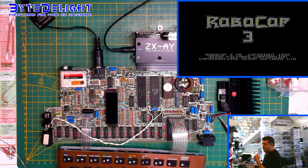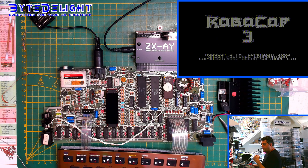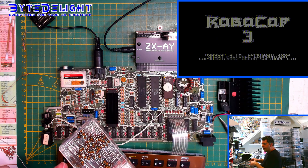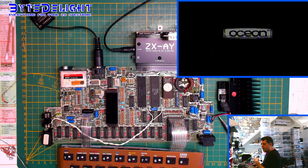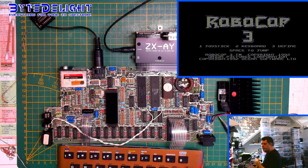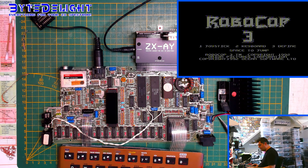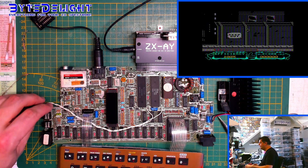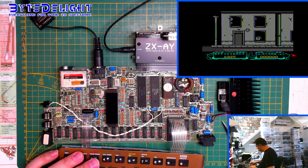This is way better — you can see it directly. Two small parts. The inductor I'm using is quite thick — I think there will be smaller parts available, but this is so much better. Even the capture device picks it up way better than before. Look at that — that's how it should look. There's not much color in this picture, but there's a bit and you can see it now. It's a lot better, and on composite video, this is a big improvement.